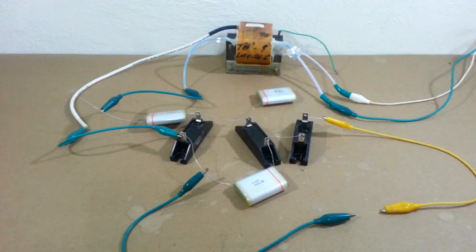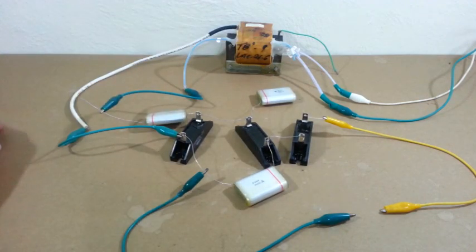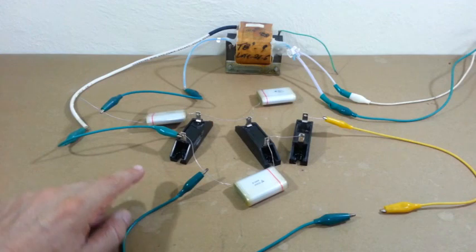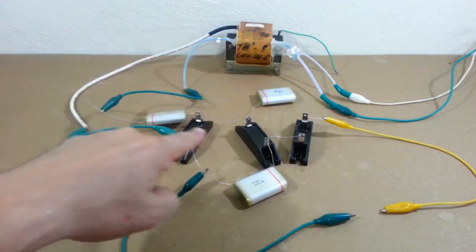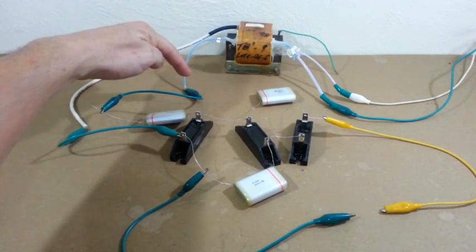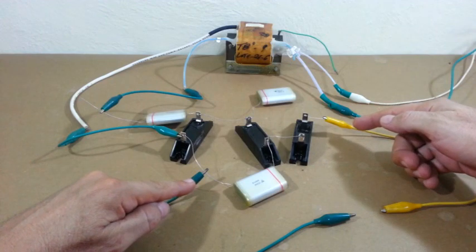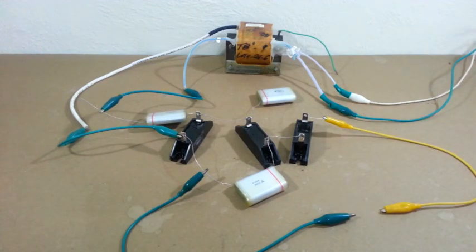In order to test the diodes, I made this quick and dirty high voltage multiplier. This is a high voltage transformer with an output of around 12kV AC. The multiplier is made using high voltage capacitors and the high voltage diodes. The AC output of the transformer is fed at these points on the multiplier, and at the output we will have a voltage three times higher than the transformer output, which is rectified DC. Here we will see the arc produced by the multiplier.